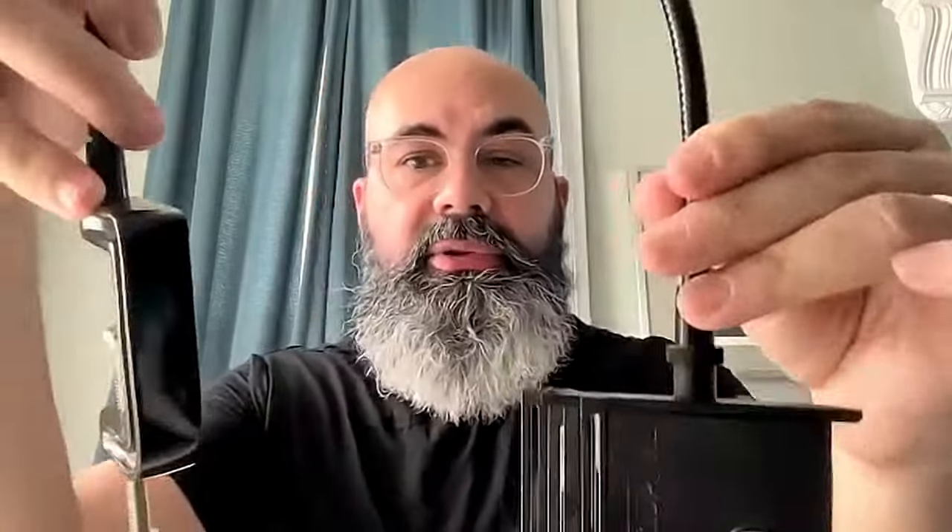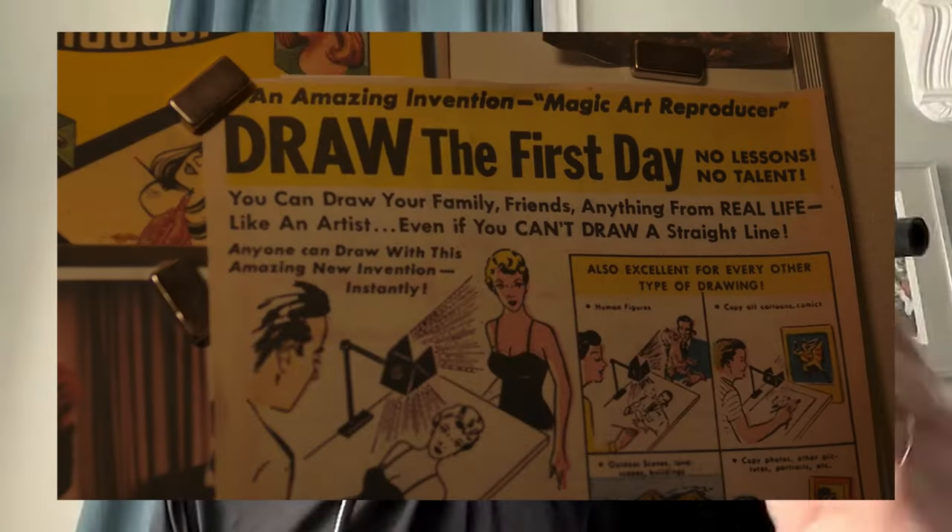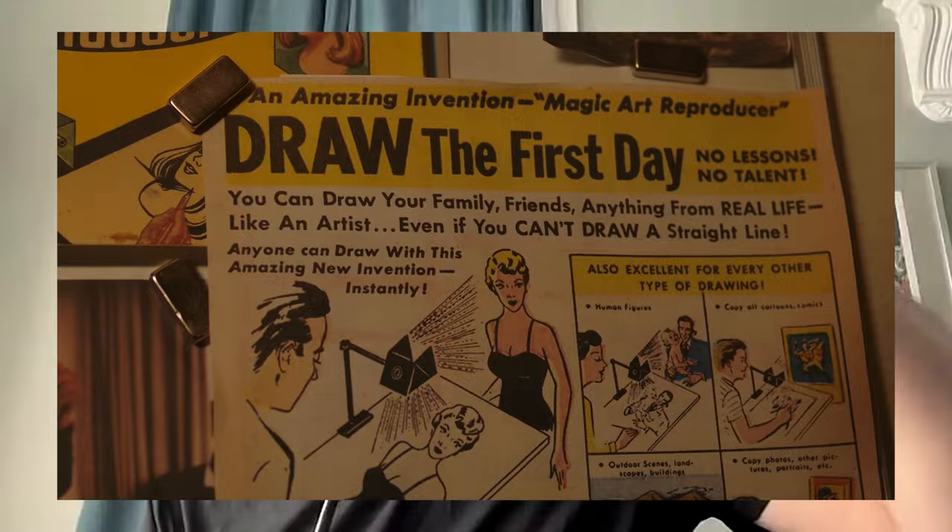In 2017, when I made the Neo Lucida XL, there was an interest in making one that was easier to use with a slightly larger viewing area, and that's what the see-through Camera Lucida can do. The difference between this and the toy is that the mirror here is a first-surface mirror, which means it's not a piece of glass with a mirrored backing behind it — which in the thickness of that glass you can get little internal reflections. The front surface of this is a very, very sharp optical mirror.